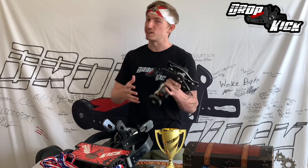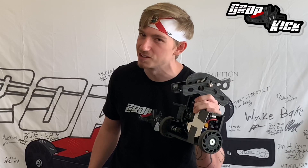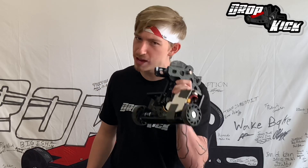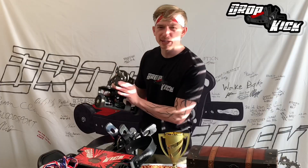You might have the motors now, but that doesn't mean anything if you can't control yourself! Pick up a pair of drive ESCs and an ESC for that weapon motor. The two drive motor ESCs don't have a BEC, so make sure when you pick up that weapon motor ESC, you pick up one that has a BEC included so you can apply energy to that receiver! I always pick up an ESC with a BEC built into it for my weapon motor.